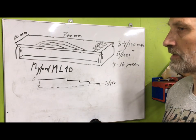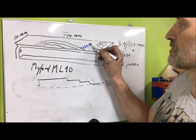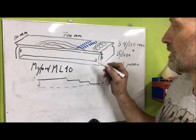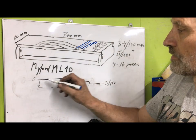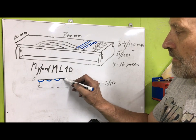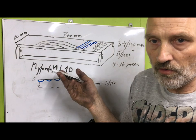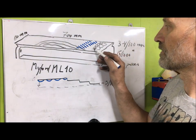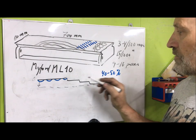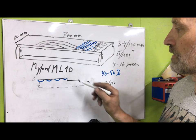When you get down to the finish stages, you of course will want to move in individual marks with this technique, the crosses it's called, when you machine scrape, also hand scrape. This will not cover the whole area, so you will have for each scrape mark a certain coverage. Area scraping here with the circles technique, I get almost 100% coverage because I remove all area which I know is high. With this technique, you're down to maybe 40 or 50% coverage for each pass. So you take it this way and then you cross your cuts, take it the other way.